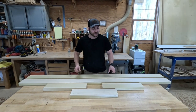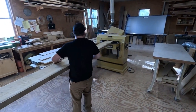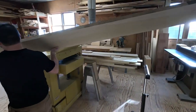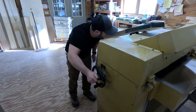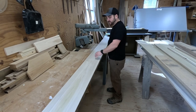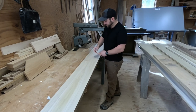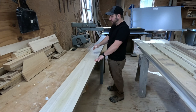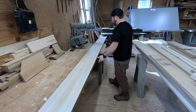In this video I'm going to be making a barn door out of these pieces of poplar and see how it comes. First I'm going to cut the sides of my barn door, I'm going to make them about four and a half inches wide — that's about the max I can get out of this piece. I'm going to cut the two side rails out of this, and then over here I'll be able to get my top and middle. So I'll cut this first.